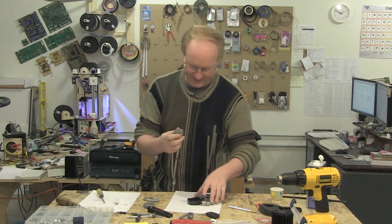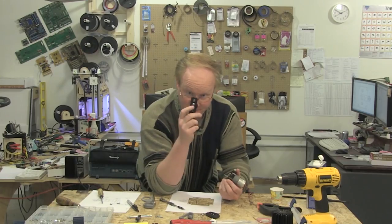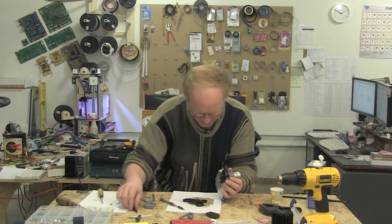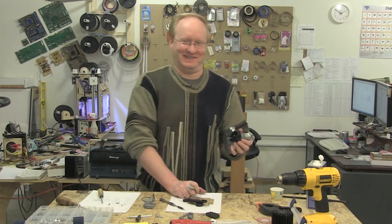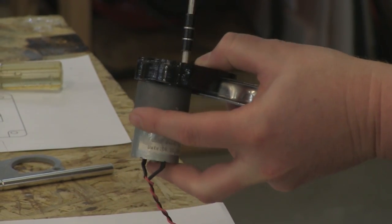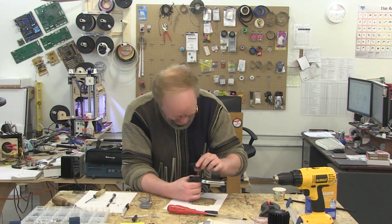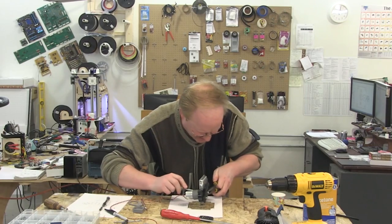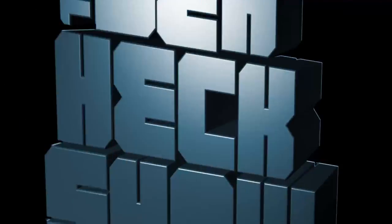Here's the motor that we have — this is the same motor we used on that zombie invasion project. Luckily the zombie invasion is over, so I can reuse the parts. The flywheel is going to fit onto the shaft inside this depression here, but I'm going to have to cut the shaft a little shorter so that it doesn't hit the arm. So the motor's here — we're going to place this over it, line this up with the shaft. Let's test it out with a battery pack — this one's 7.4 volts, it's the first one I came across.